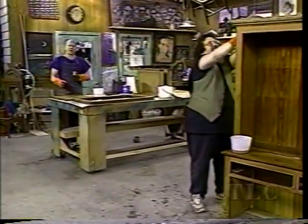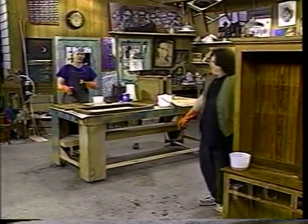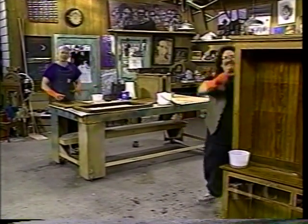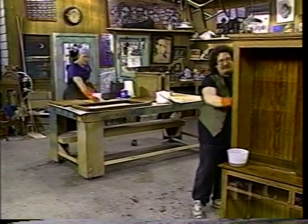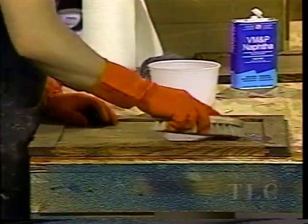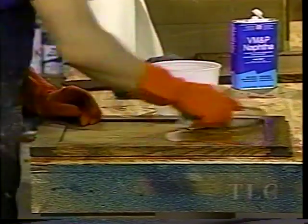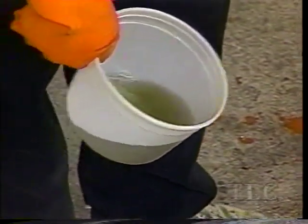We're washing down with a final wash and naphtha for the piece we stripped with the orange stripper, and then it was slow down, boys. Lacquer thinner and alcohol got off the residue, and the planter chips, you saw that, they're always so much fun. And now we're doing the final wash with naphtha to make sure all that residue is gone. And if you think nothing's coming off here, just take a look at that. It is getting dark, so we are taking stuff off.